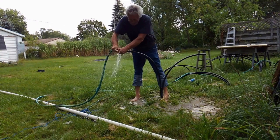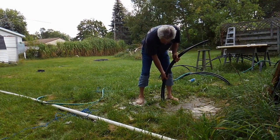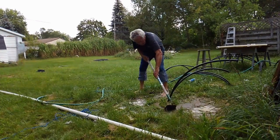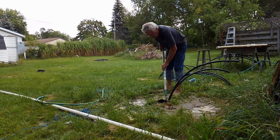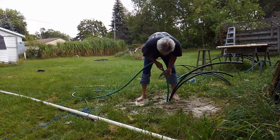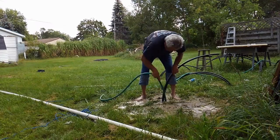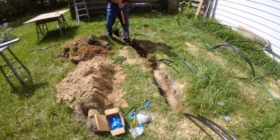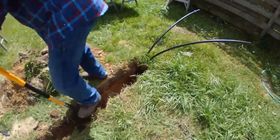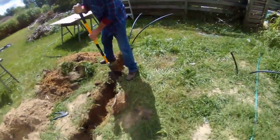These are at least 15 feet in the ground — two tubes. That's 30 feet of tube in the ground for each hole, times 10 holes. It's about 300 feet of three-quarter inch tubing that's in the ground in that circuit. Then you pull the dirt back in the hole and wash it in. Take your time, fill that hole back up the best you can. We washed it down and filled it again to get that dirt down around the pipes. If there's air, it's not going to transmit the heat very well. The idea is that these tubes are going to pick up the 55-degree heat that's in the ground, and when it's zero outside, that's a lot of heat.